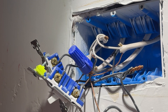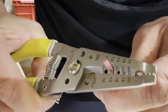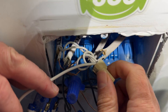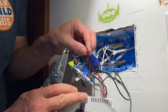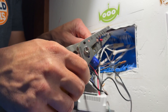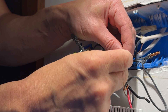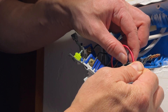Just because this one is the furthest back, we're going to wire this one first. The instructions say we need half an inch of wire exposed, so now we've got half an inch of play. It is important to remember that this is for a single pole only — you're not supposed to use this on a three-way circuit. With the neutral wire we can push it back and get it out of the way. Now we're going to connect the red wire to the fan black wire. Usually on these types of switches, the red always goes toward the fan. The wire nut is too big for just two wires, so we're using one of the orange ones that came with it. Pinch them together, wrap it around to get a good connection, then put the wire nut on. When it's on you shouldn't be able to pull it off, and you know it's tight enough when twisting it starts to twist the wires themselves.